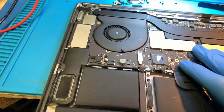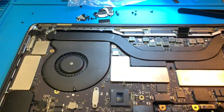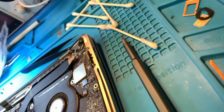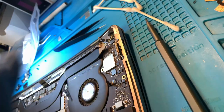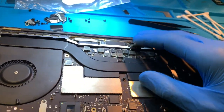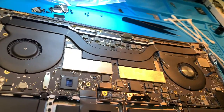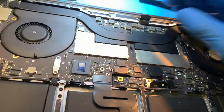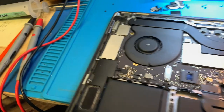I went ahead and put the board loosely back in the housing — none of the screws are in. I've just connected everything needed to test it. I didn't connect the screen because I doubt the screen is in any kind of working condition. From my experience, if you have the internal display connected it will not go onto the external display. So we're going to leave that disconnected and try to connect it to an external display to see if we get image.